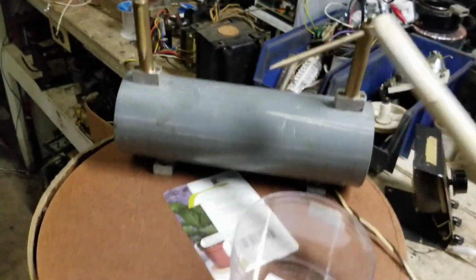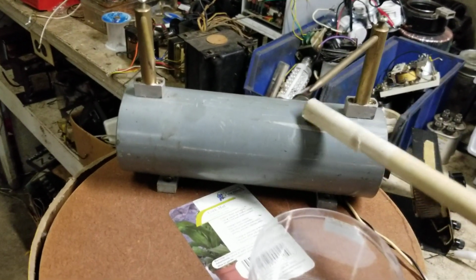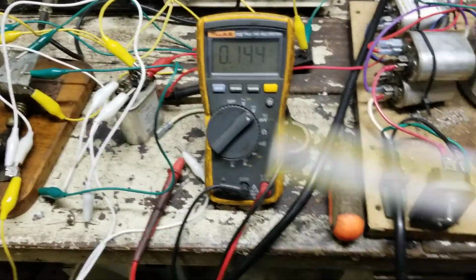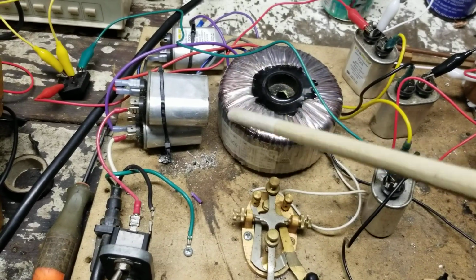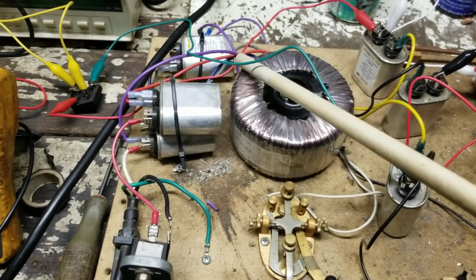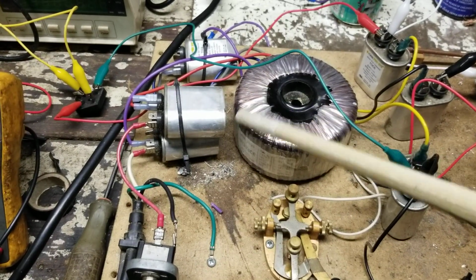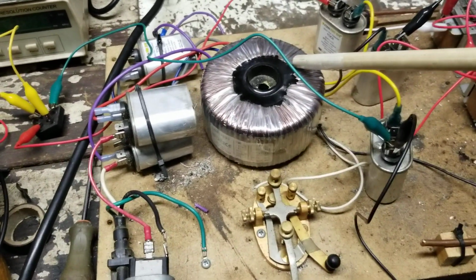I've been having arcs now. This is like way over current and over voltage for this thing. It needs to be sitting in oil because the arcs are jumping all the way down here, and I think I mentioned that already. Where's this voltage coming from? Two primary coils wired in series. It's a 240 volt transformer capability by using both in series. But I'm only putting 120 to it, which means that the voltage should be half out here. So 44 volts